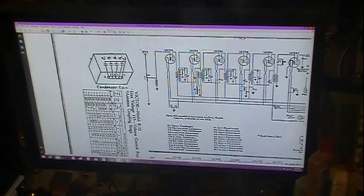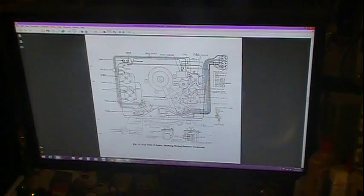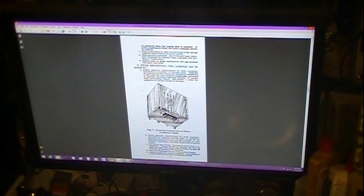There's five connectors. One is common, so 4 caps in there. And on this one, just like the other one, if I can find, yeah, right there it is. There's only 4 taps on it. 1 common, 3 caps, and they're different sizes. 2.5, 3, and 5 microfarad, where this one radio had 2 microfarad, 2 4 microfarads, and a 6 microfarad. So there were some changes done in that too.